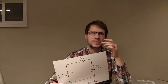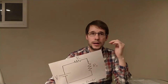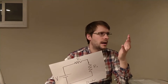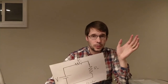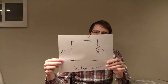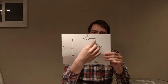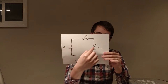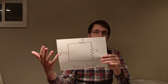This circuit would be useful if, say, you had a nine-volt battery and you wanted to charge your smartphone and needed about five volts, or maybe you have an electronic component like an LED or a light bulb that can only accept five volts. If you put more than five volts across it, it's going to fry it. If this was just your light bulb with one resistor, it would get all the voltage from the battery — nine volts — and that might blow it up.